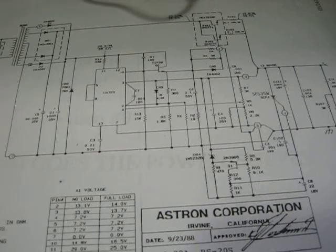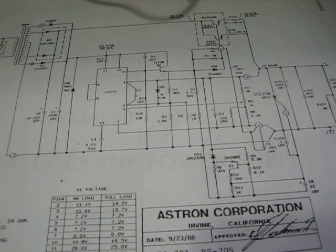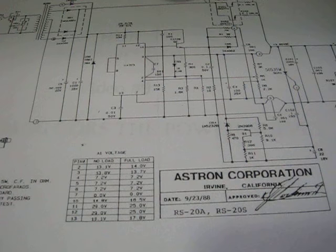So you can always do that, and that's typical of most lead acid batteries. You can put it at that float charge rate, and you should be able to keep it on there indefinitely, as long as you don't exceed that charge voltage, the quick charge. But just take a look at the data sheet for your battery, and it'll tell you what the float voltage is for that. And that's it.